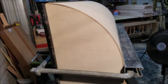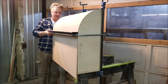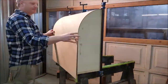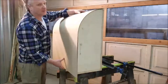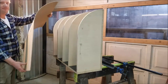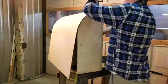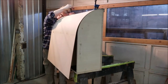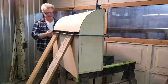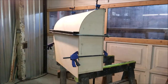I've got to ask what everyone is thinking — what is going on with your hair? Now, remember I'm making a veneer cabinet box and I'm going to be applying a wood veneer on top of this MDF. If you're using this technique to create a form for acrylic, you could put fasteners in the face, but just make sure you make your form wider than your piece of acrylic so you don't transfer any fastener marks into the warm acrylic. I'm taking extra care so I can apply a veneer without leaving any marks over the entire surface.